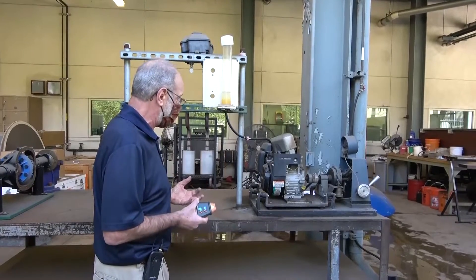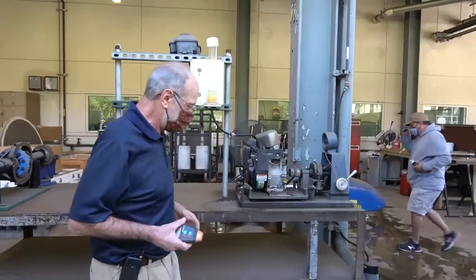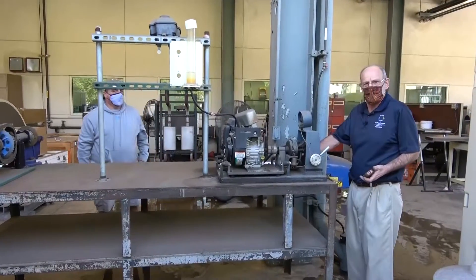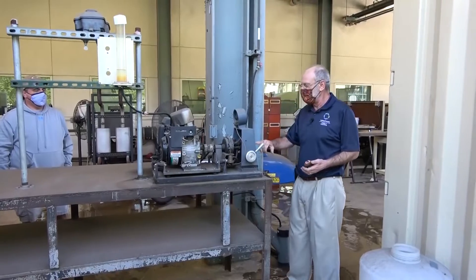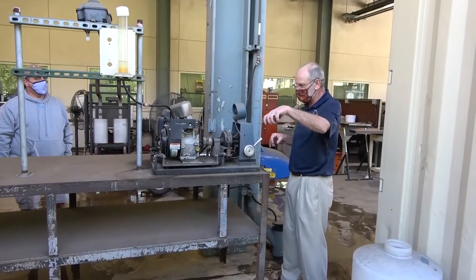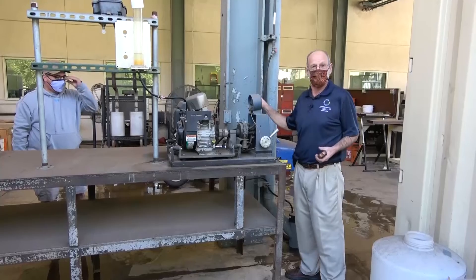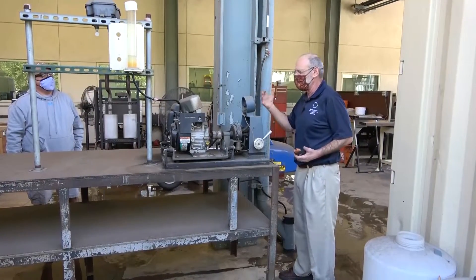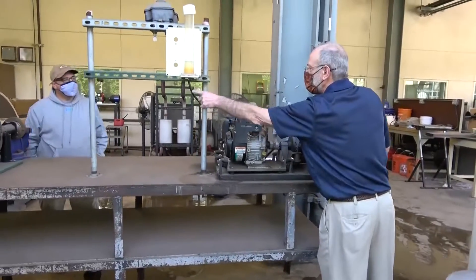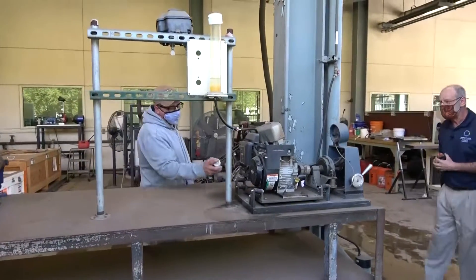We're basically ready to go. Our lab technician Dave will come over and start the engine. Once it's started, I'm going to adjust the load in one-pound increments — you'll see that causes the speed to drop each time I increase the load. At each pound, I'll record the speed with the tachometer, record the load in pounds, and do the fuel flow measurement. Then we'll increase by one pound and repeat until we're done. There's also a little valve in the fuel line — make sure the valve handle lines up with the tubing to confirm we have flow.